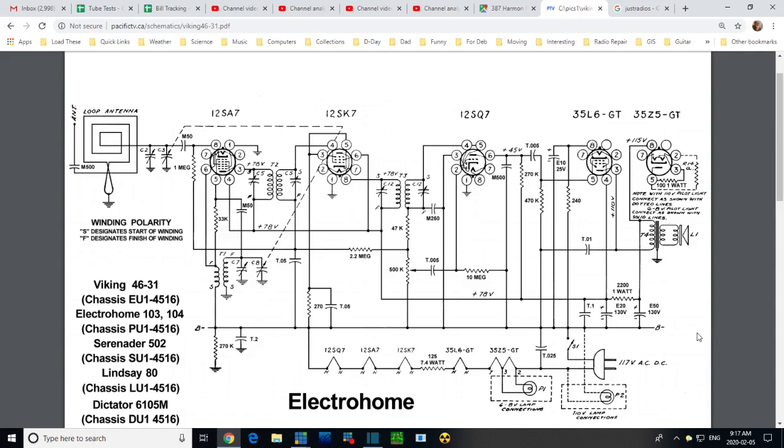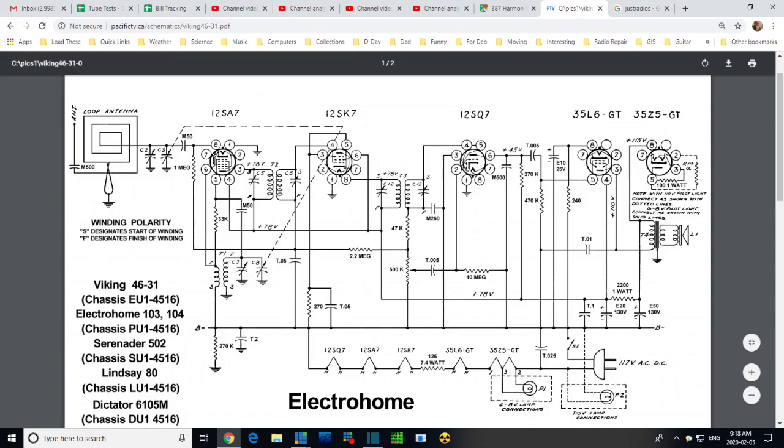Okay, so we're looking for what I believe is the antenna coil. Now, how do I know that's the actual antenna coil? It may not be. Well, obviously the antenna itself is a coil. Well, this is the only other one in here. Really? No, there's this. Well, that's an IF coil. That's an IF transformer. So it must be this. It must be the oscillator. So I kind of thought it was an antenna thing going on up here, but it's not.